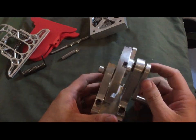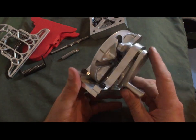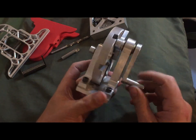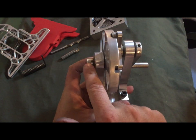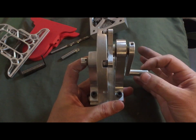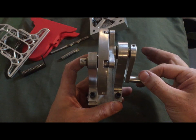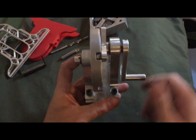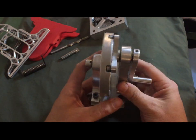I think the interesting thing about this is the gear ratio here is a 2-to-1 ratio. Every time I turn this, we'll take a look at that little hole over here, and we'll watch it as I turn this around. I'm going to start at the bottom, and we'll go once around, and that's the other side of that hole, and then twice around, and that's the hole. So that made 1 revolution when I did 2 revolutions on that side.